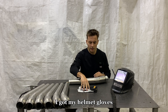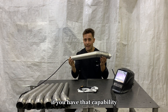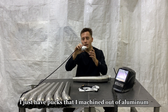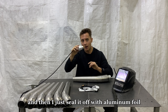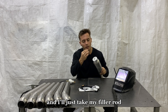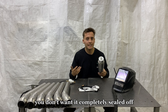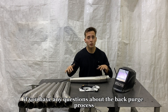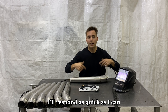I've got my helmet and gloves. I want to remind you guys to always back purge if you have that capability. I just have pucks that I machined out of aluminum with quick-release fittings to attach and detach the line. I seal it off with aluminum foil on both ends, and I poke a couple holes with my filler rod to allow that gas to escape — it needs to bleed out. Otherwise it'll try and push back on the underside of the weld as you're going. If you have any questions about the back purge process, drop it in the comments below.